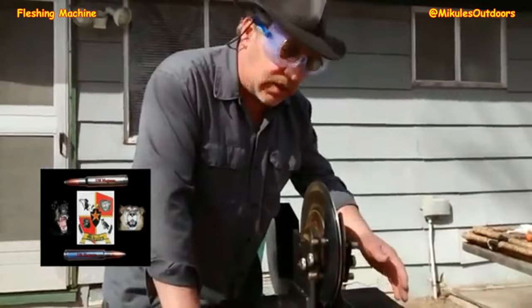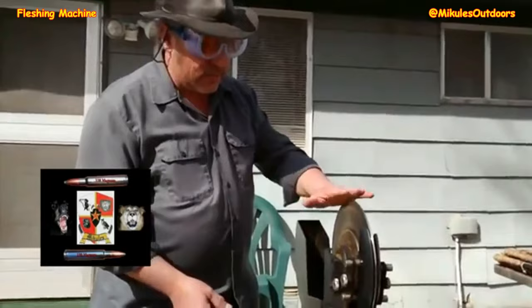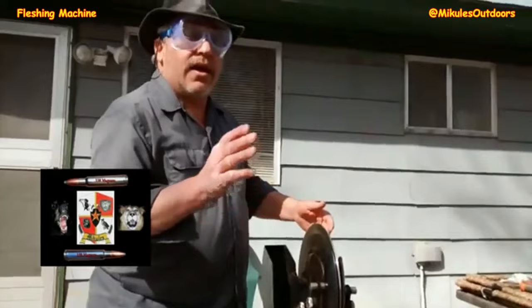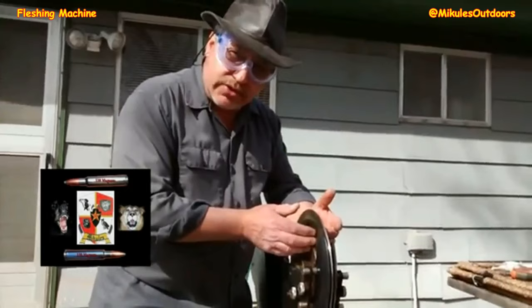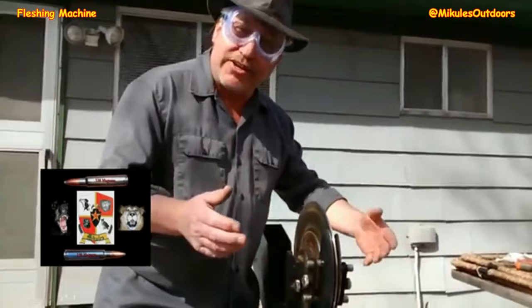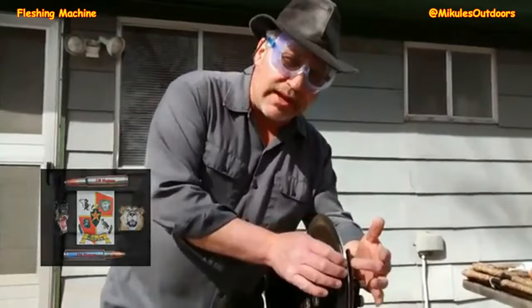You have to work to keep your machine clean. Just sitting around, this thing will get rusty up in the blade area. So what do you want to do to clean that up and make sure it's clean and sharp again? First of all, this is a blade — a fleshing blade — it's got a lip on it. That lip is usually razor sharp. But a lot of people, when they get it back from being turned and sharpened — that's the terminology, you turn the blade and get it sharpened — it's so sharp that you get up there doing your thing and all of a sudden you've got a hole in it. There are some people who actually go back and dull the blade, or they get into meticulous arrangement and adjustment of these blade guards.